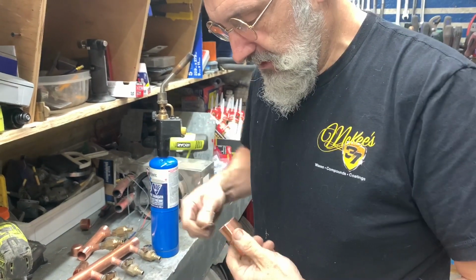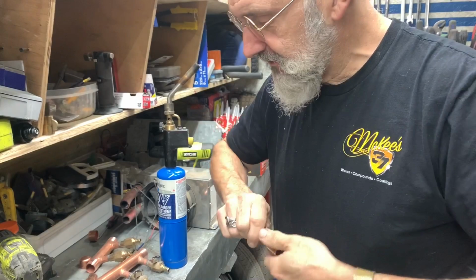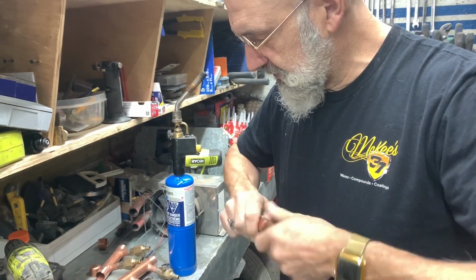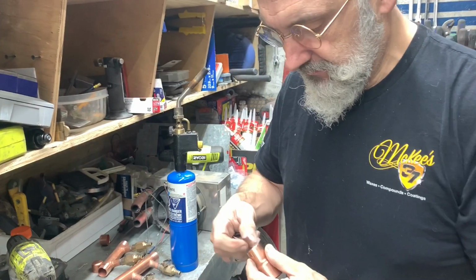So when we're prepping things to be soldered, two things need to happen. We need to sand it, and we'll be using an acid flux. The acid flux helps the solder to go into the joints